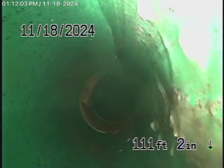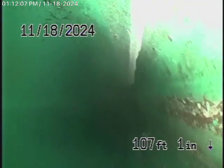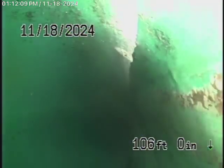We're going to bring the camera back as far as we can push it. You can see connections along the way that are picking up other units — we're way into the line, and we've been able to check the line all the way going out. This is all pretty new, this line. It's all in very good condition.